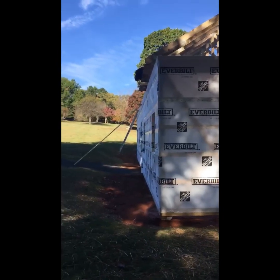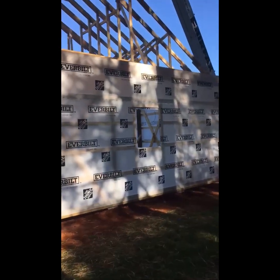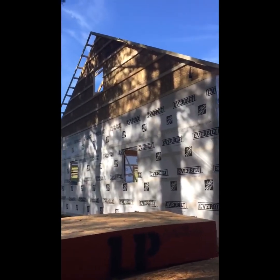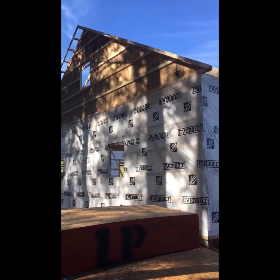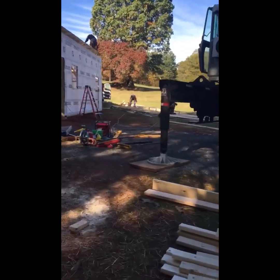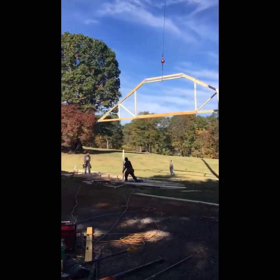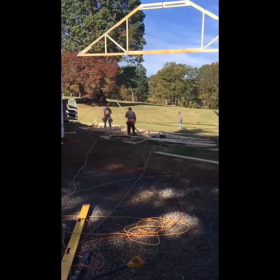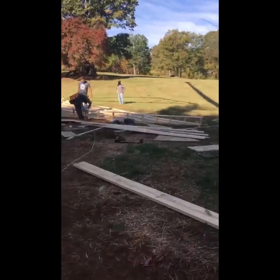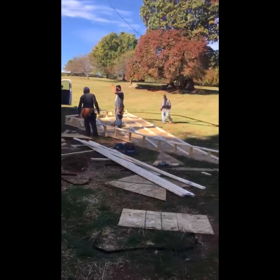As you can see, there's the overhang in the back. I'll be checking back in — I've got to get up on the roof here. We've got the gable truss set. We're putting our ladder frame in for our overhang on our gable trusses on the ground, which makes it a lot easier to pick it up and set it right in place.